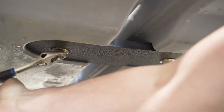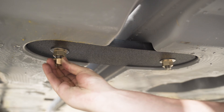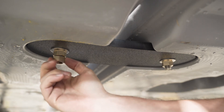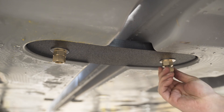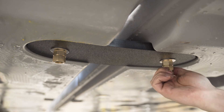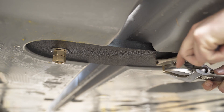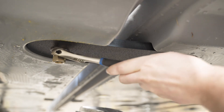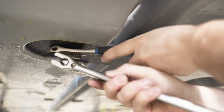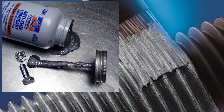Once the link is firmly in place, put a second brass nut — this one will be used as a jam nut. You will need to squeeze them against each other using a second wrench. Please note that we use a brass nut so you don't have to put anti-seize grease on the stainless steel rods. But if you ever replace the brass nut with stainless steel ones, make sure to use proper grease.